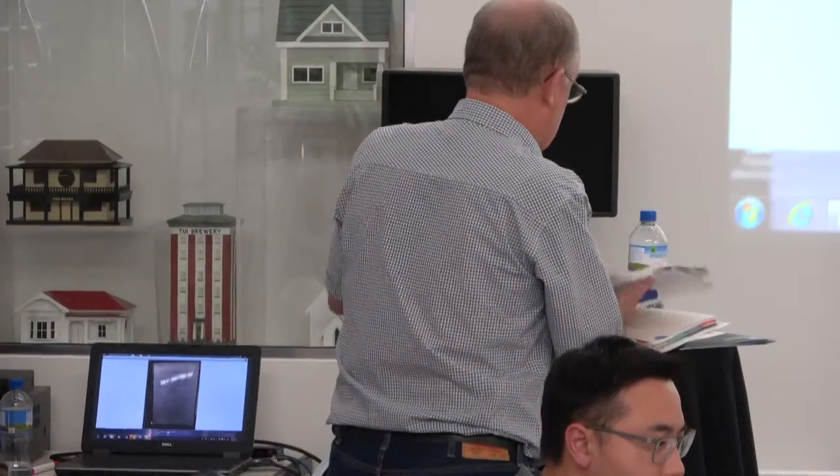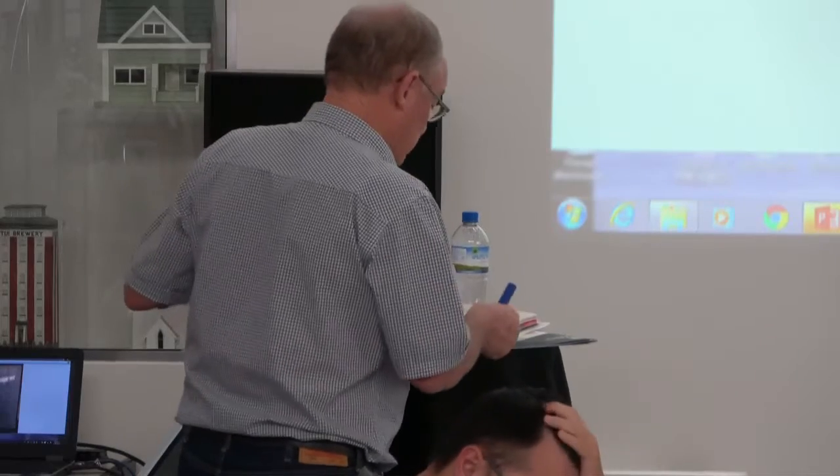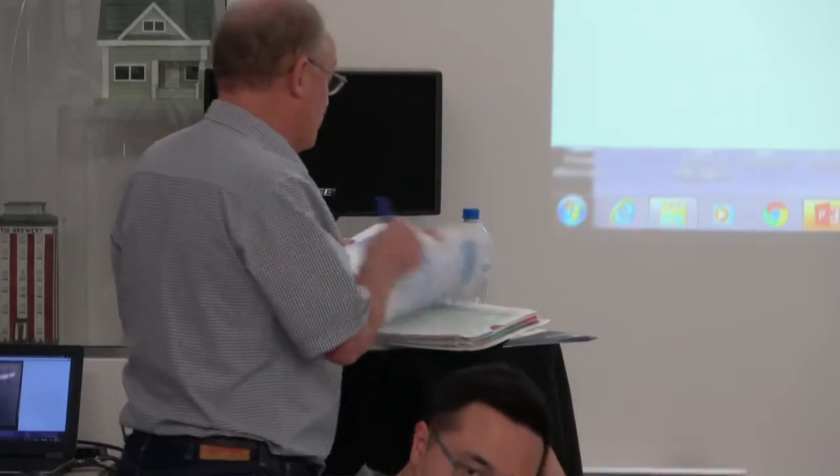But there's a whole section in here on the cladding systems, on ceiling. I'll just see if I can find it. On the grade of timber that you're going to use. Walls and grading, and it's all about whether it's an SG10 or an SG8 or an SG, whatever system you're going to use. But it's all throughout this book of NZS 3604.